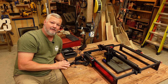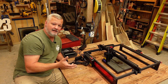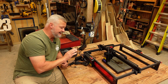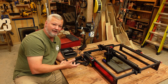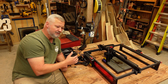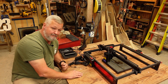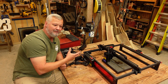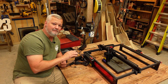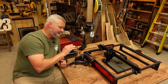It takes some getting used to — I still haven't mastered it, and that's one reason I want to wait on my project video until I can show a project where I can utilize the Z-axis to its fullest. It is really handy to have when cutting thicker materials. The only downside is, because it is a diode and limited on the focal range, you're not going to be able to go really deep because at some point your module will end up impacting the workpiece. I've found that going down two millimeters on general plywood, there are no problems, but at four millimeters it gets a little more sketchy — you've got to make sure your material is perfectly flat.